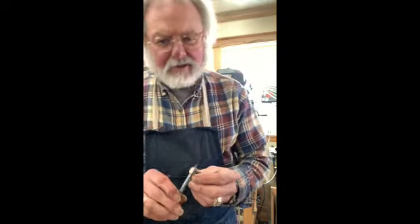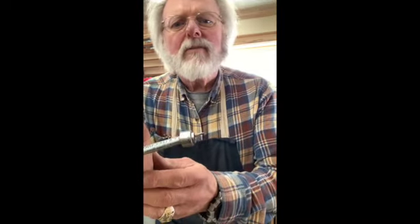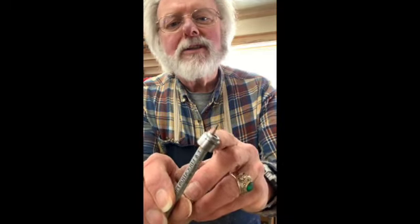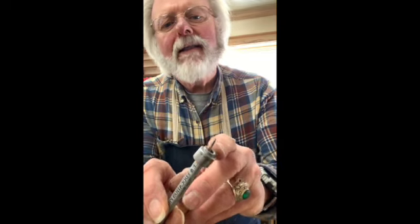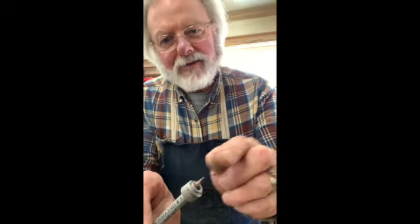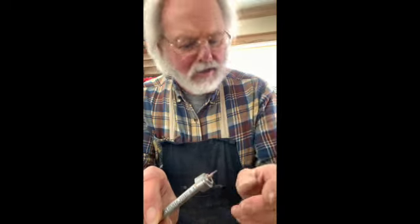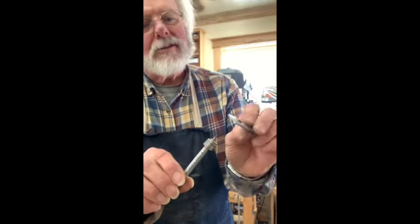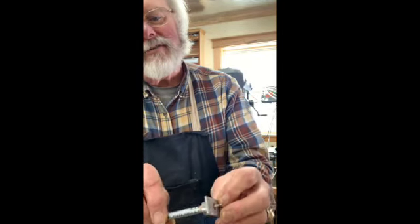So the first thing I need to do is make something to get this bushing a little bit wider. You can see the very top of this, that shoulder that's on there. That's not quite long enough. It doesn't extend far enough into the drum sander. It does to accommodate this, but I'm going to rebuild this in 1/8 inch steel. This is just over a 1/16 of an inch.